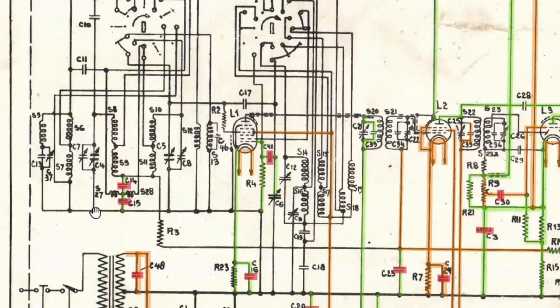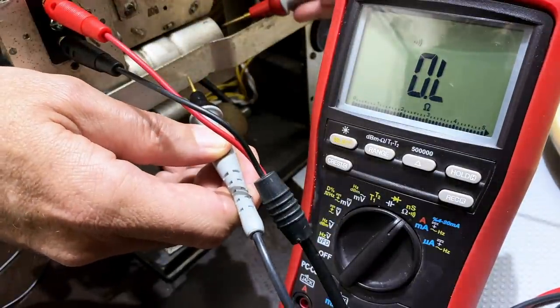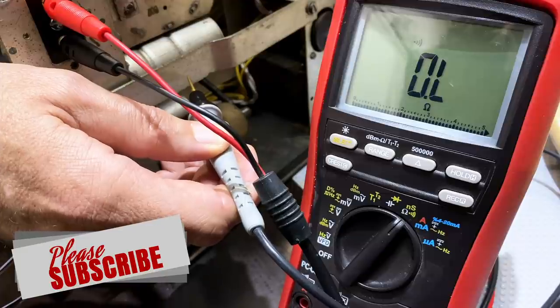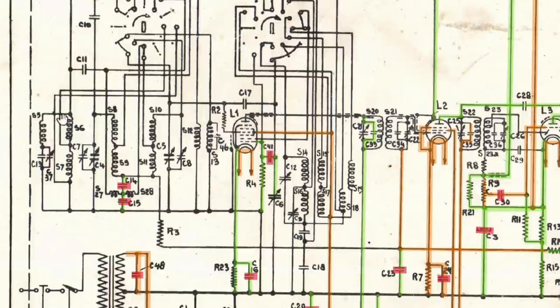Now, what I need to make sure of, because I don't want to interfere with this, is that the cap sticking out the top is the ground end, because remember, this thing's got two sides. One of them is not ground, the other one's ground. I believe it's the ground then, and it's very easy to check. I can do that in a second. C12 is not connected to ground, and fortunately, I don't think I'm going to have to adjust that. You see, this doesn't go to ground, but these guys certainly will.